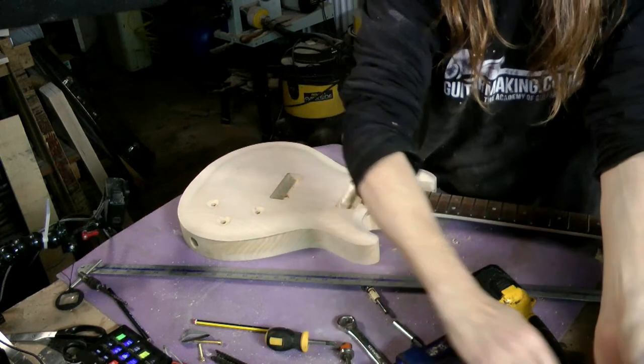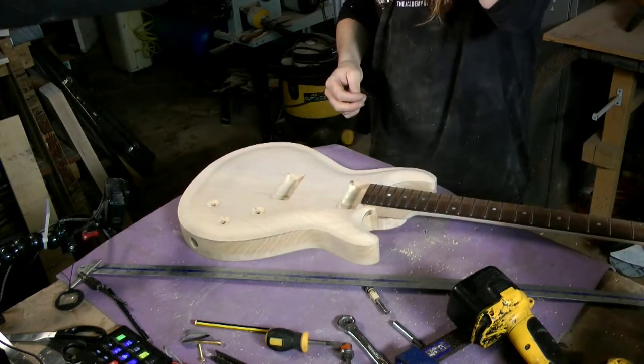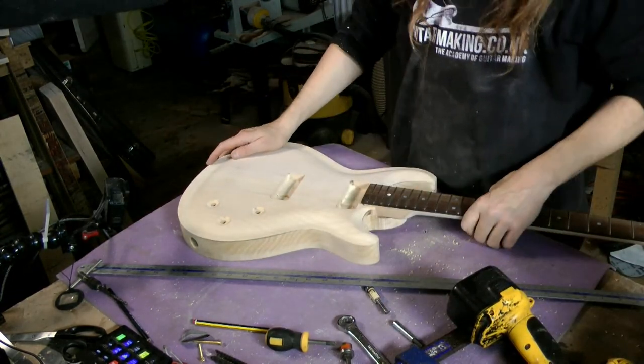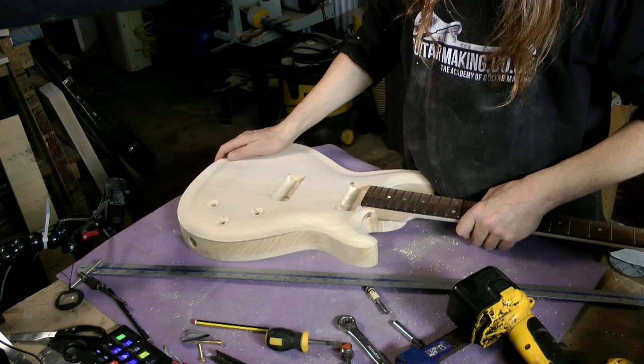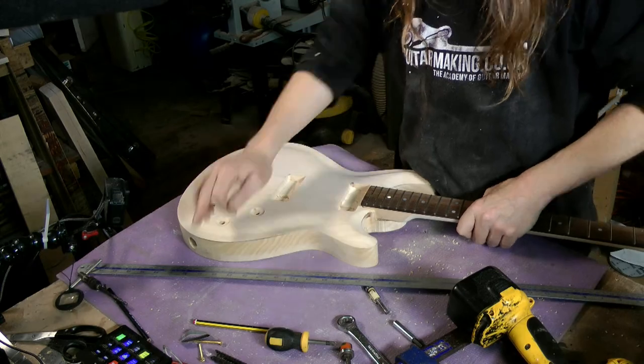Clinton Superclunk is saying you need a reference hole with the brad point, small bit first, then big. Yes, that's what I'm saying. Drill with a small hole and that centres the big hole for you. Makes it a lot easier. But as I say, you can do it either way round. But I would test it on some scrap before you try drilling your expensive guitar.